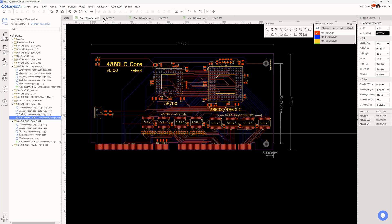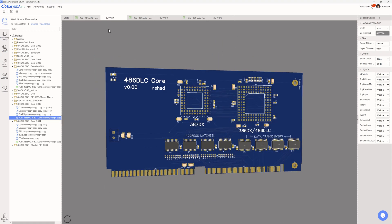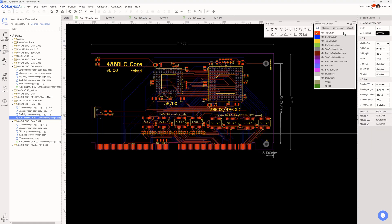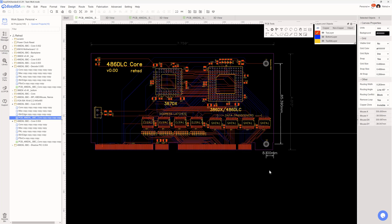This card is only a four-layer board, so I was able to drop down to four layers with just two signal layers, a VCC plane, and a ground plane. That gives me good power distribution and thermals, so I should be pretty good on all of that.